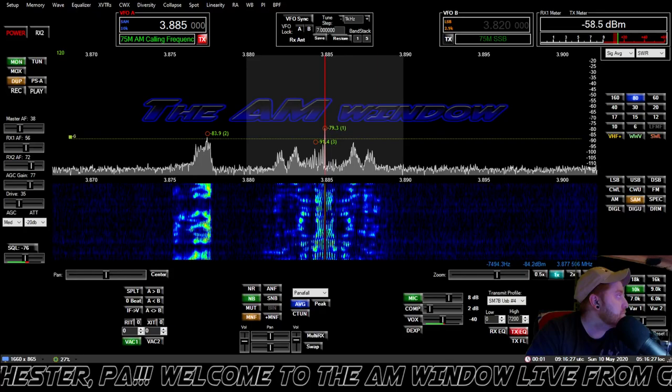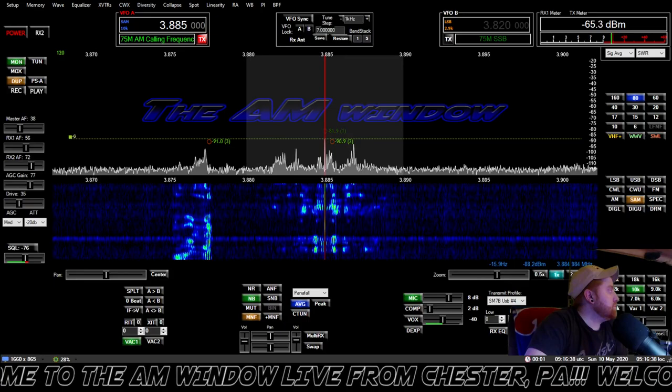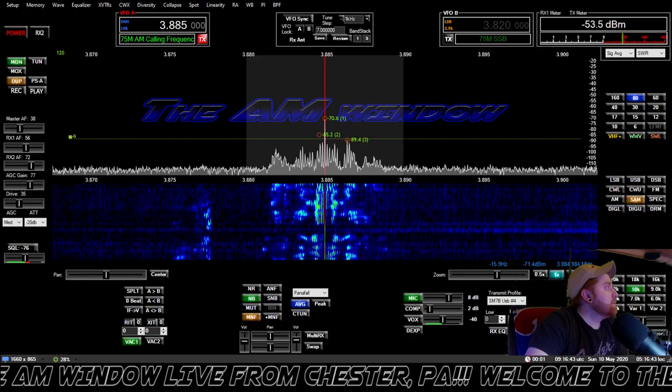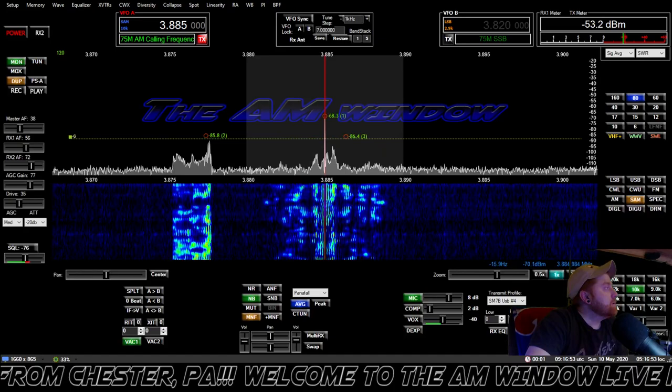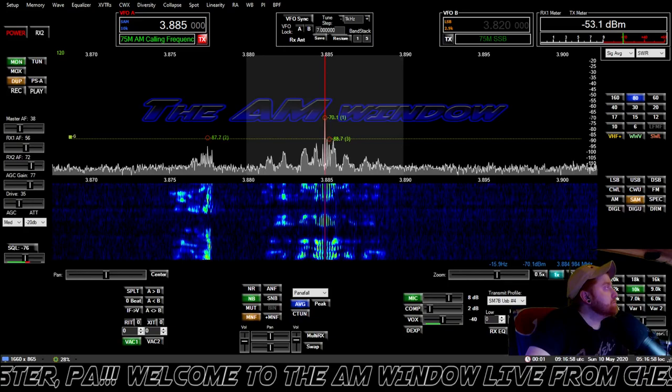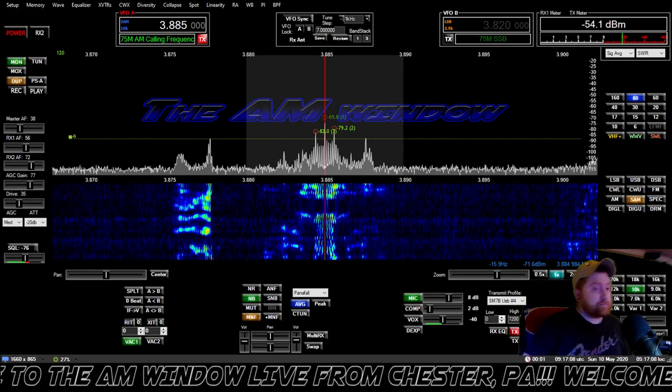And I would think on AM, I know it works better because I did put one up here on 75 and ran it for a while. But I took it down before the wintertime hit, just wanting to configure some other antennas in the backyard here, and just went right back to the standard half-wave dipole. But it does work well, and I did set mine up flat top to get that done. So that was the name of the game for the turnstile antennas. Anyway, back around to you there, Terry.